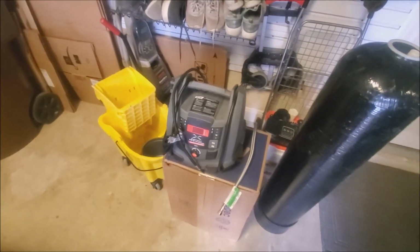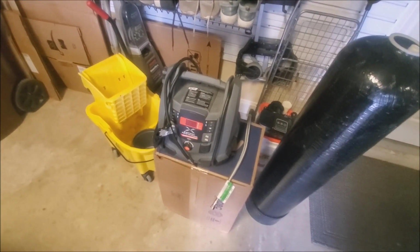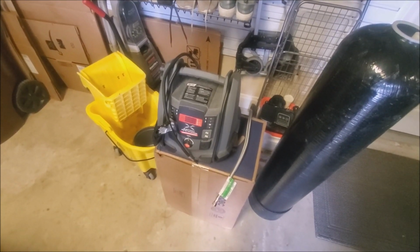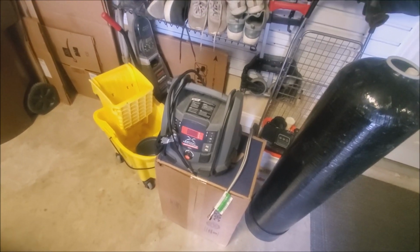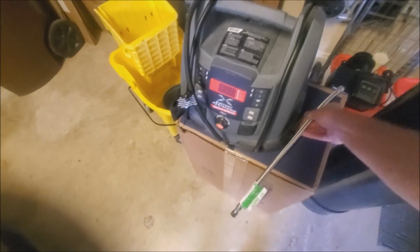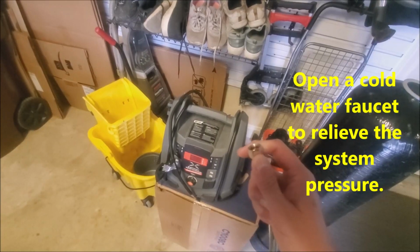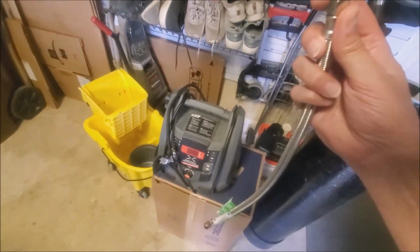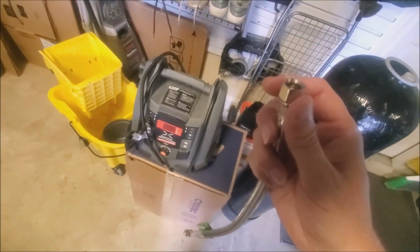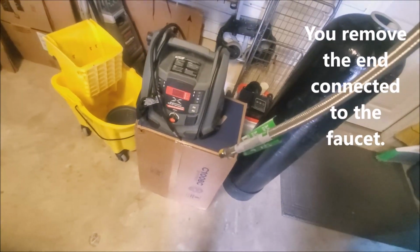You're going to want to shut off your main water supply, I should say. And if you have blockage there, get yourself a bucket and disconnect the hose, so you have some hose to work through. So this end that would go to your faucet is on the shutoff valve, this end is on the faucet. So then you can open up your shutoff valve with the water shut off.